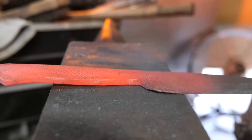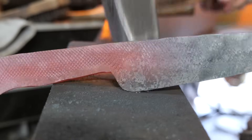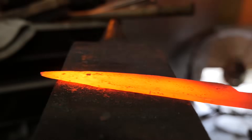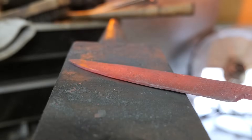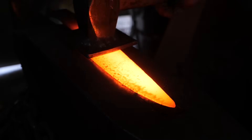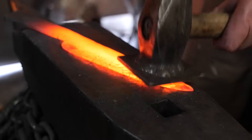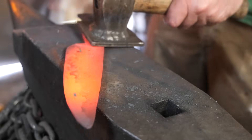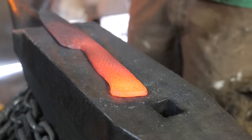I have a flatter here — you'll see in a minute — I'll bring that out and try to get some work done with it. Got the distal taper in place and here's the flatter. Nowhere near as efficient or good as the press for doing this stuff, but it'll have to do.